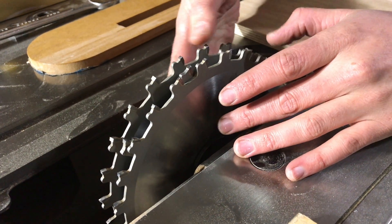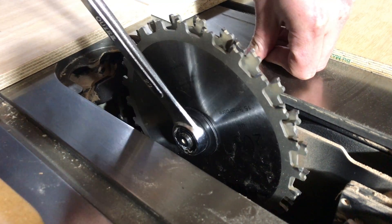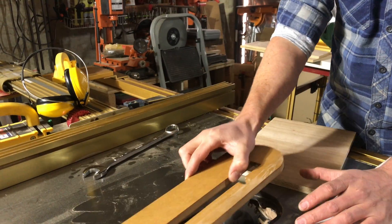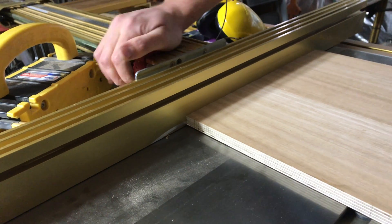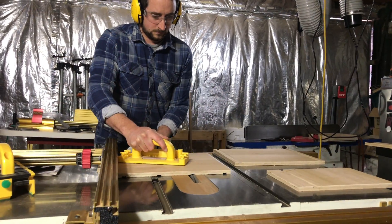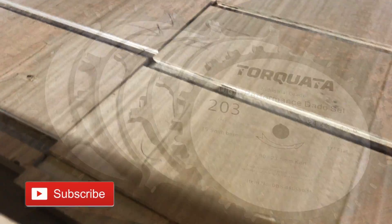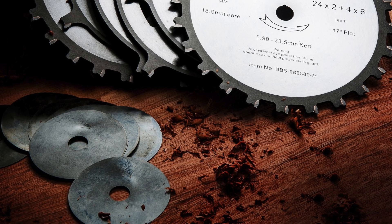So what's the real advantage in getting a set in metric? The real reason for me is that all of my tools are in metric — every measurement device, every drill bit, every router bit. When I'm using these shims and these blades I know exactly what 0.5mm, 0.3mm, or 0.05mm means and what it's going to add to my cut. I'm really comfortable with this, and it makes sense that the measurement system is the same as everything else in my shop. I think this is the only fully metric dado set on the market, and it just doesn't make any sense that we're still using imperial systems when everything in my shop is metric.